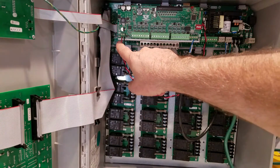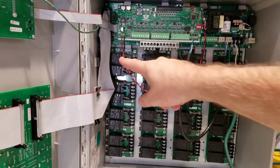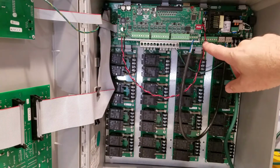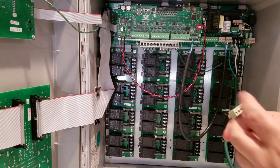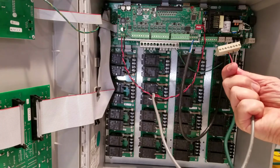On this connector you do about a 1/4 inch strip on each of them, and these screw terminals, first the plus 12 and then the minus. So in this case we ended up using a cable with the end. You could also do it with just regular signal cable, putting the red and black on that end, and then on the other end you could just use one of the blocks from the interconnect board.